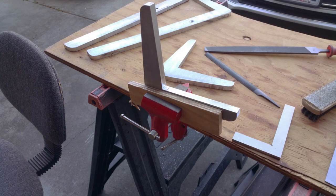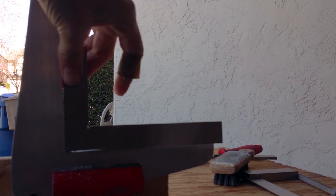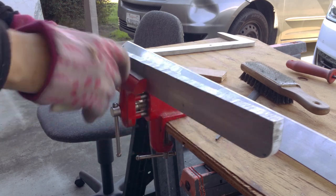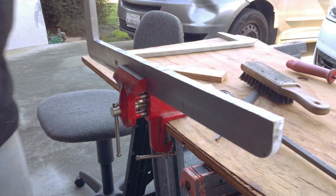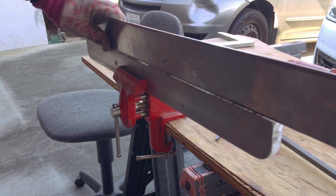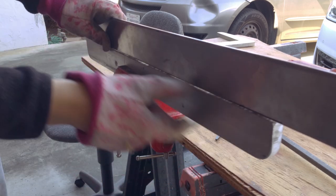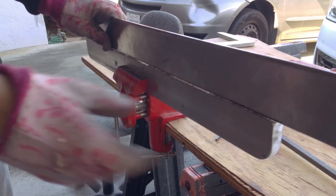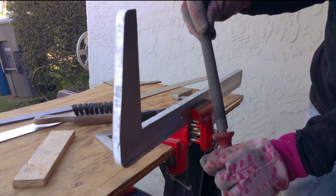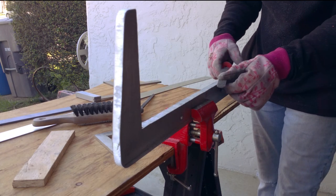It's just a process - these are the easier ones. If I put the square here you can see light coming through there, so wherever it's tight you have to remove material. Before I even worry about how level this is, I want to take off the high spots. I have this kind of art-store straight edge and you can see a lot of light under here, so I have a lot of work to do. I'm going to knock off the highest spots and then start measuring it to see how parallel it is.